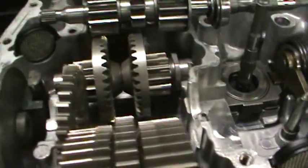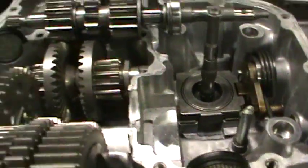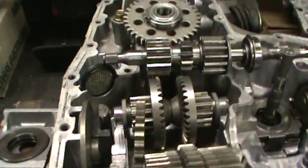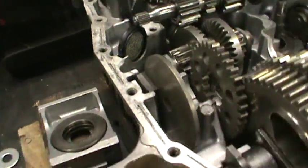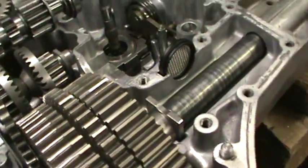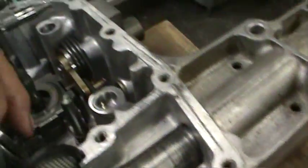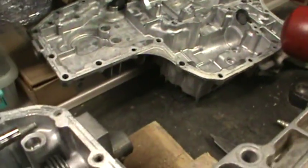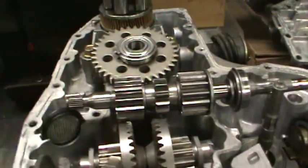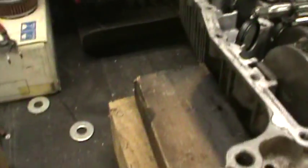I don't think that's going to be a problem — I doubt if it even causes any noise. So that's where we're at. We're going to finish removing the silicone on the case halves and bolt it back together. Bearings in the slosh plates are still good. Everything is in pretty good shape other than this localized damage here.